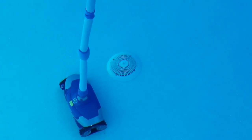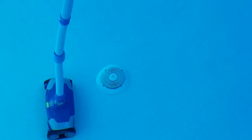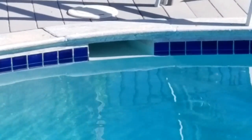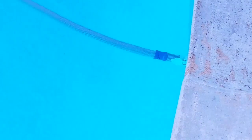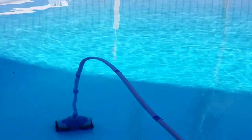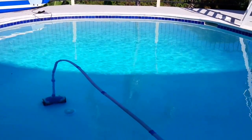There are several basic ways that the water gets from the pool down into the filtration system, starting with the main drain — the circle you see there — the skimmer port, and generally pools will have one to two skimmers. And then if you have a vacuum, it'll also be considered a way that water will get from your pool into the filtration system and then back into the pool through your returns.